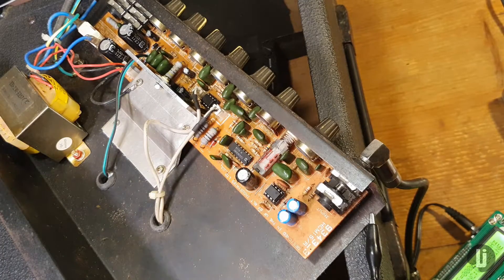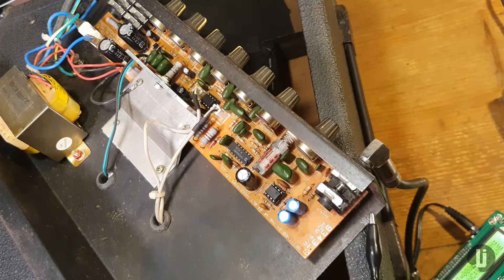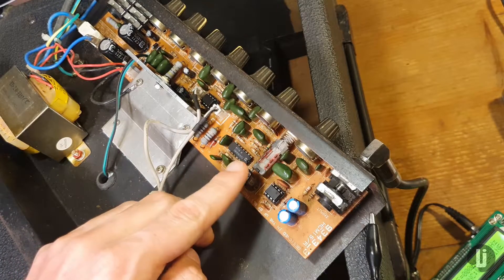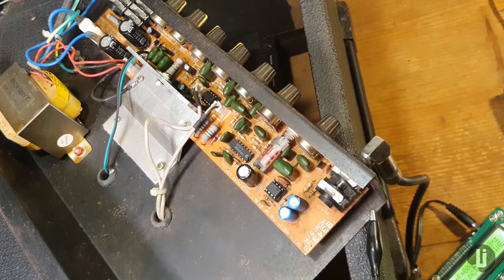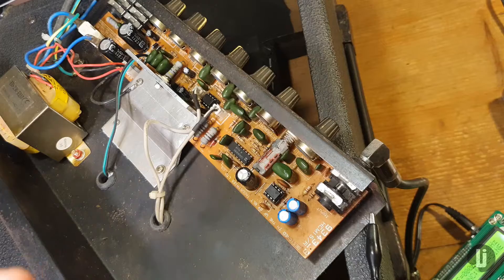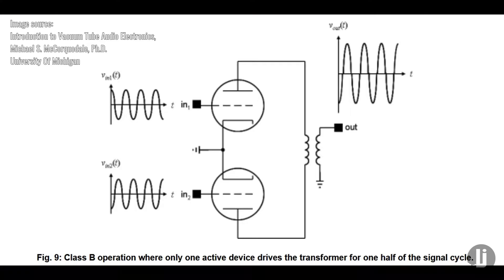That's gonna sound like shit — that's the way digitally intended devices work — unless you get clever and create some feedback networks around them, which I'm not going to go into details on; you've got the schematic if you want. You make it work like an audio amplifier. Each and every one of the four gates used in this circuit works as two transistors in tandem — two field-effect transistors, which work pretty much the same as a tube. Instead of grid, cathode, and anode you have drain, source, and gate. Two in tandem in push-pull configuration gives you basically the same thing as a class B or AB amplifier with tubes.